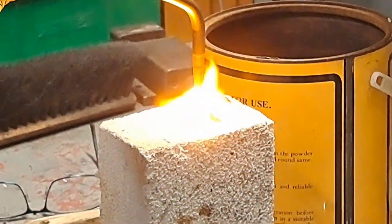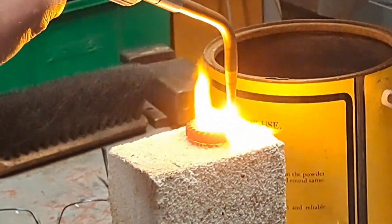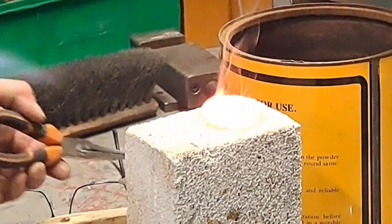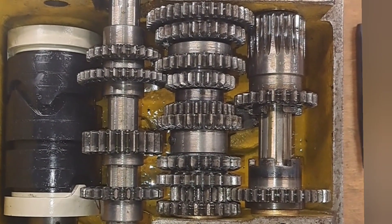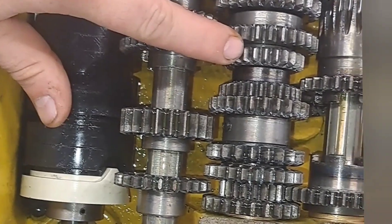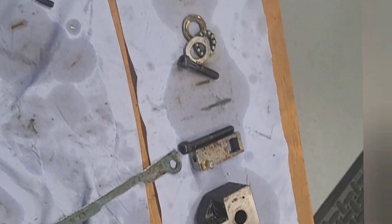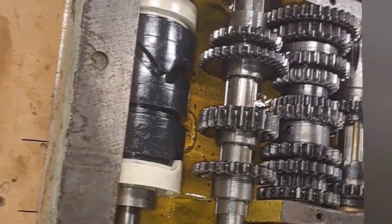All that I'm doing here is making sure that the gear is back to a decent hardness so that it won't get messed up again whilst inside meshing with the other gears. Here we've got all the gears back in position — it's quite an intense reassembly. You need to be sure of each location of each one of those separate gears. Make sure you've noted them down — remember my previous episode, I took those notes, use those notes and do the reverse of that. The gasket is quite damaged so that's on back order; once it arrives I can reassemble the gearbox to the lathe.